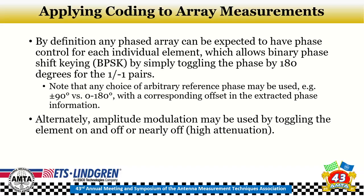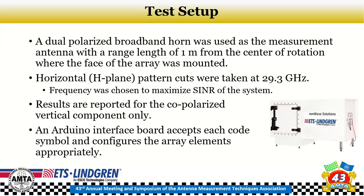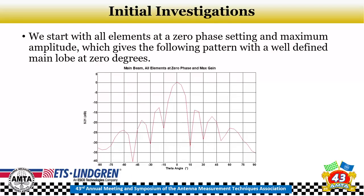Alternatively, we could do amplitude modulation by toggling the element on or off — or nearly off by applying high attenuation. For our test setup, we used an 8×8 phased array obtained from the University of California San Diego, mounted in our AMS 5700. We added an absorber shroud around the feed section to minimize coupling from the cable and circuit elements going to the array. A dual-polarized horn is used as the measurement antenna at a range of one meter, operating at 29.3 GHz to maximize signal-to-interference-plus-noise ratio. An Arduino interface controls everything.